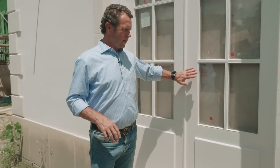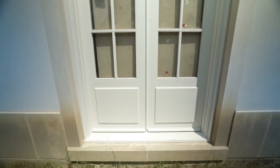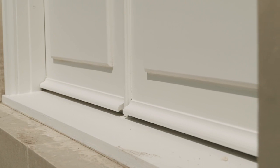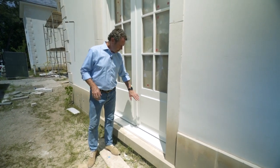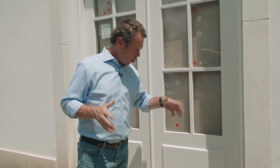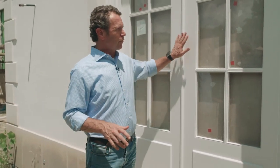One of the things that we did is we made French doors. Now what does that mean? Well, French doors typically have this raised over panel on the lower panel. We also have an integrated drip edge into this door. If your doors are failing or not working properly, you can watch my door video because I talk about drip edges quite a bit — we've saved some projects because of the drip edge. This door has an over panel, so there's an interior panel and then this over panel, so no water can get in down here. This keeps the water away, hits the sill and runs away. This is French style detailing we actually got from French pattern books, and it really makes a difference in door performance as well.